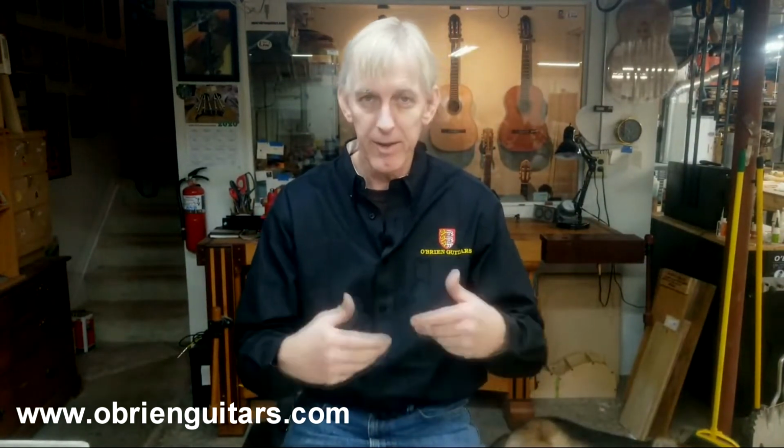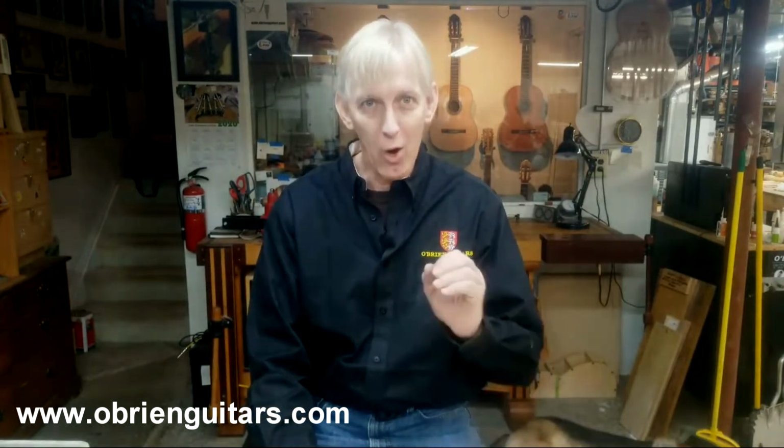That's the business end of the tool. That's what you actually want to spend your time on, getting it sharp. And if you did everything properly, that should be a breeze. It's just that last little 32nd or 16th of an inch on the tool. I also showed you how to prepare a scraper as if it were right out of the box, and how to roll over the hook and the burr, and how to use it. So I hope this has been useful.